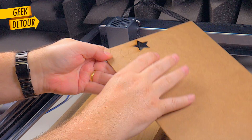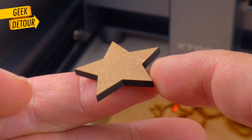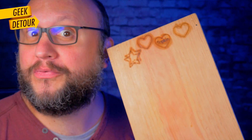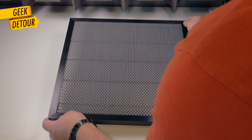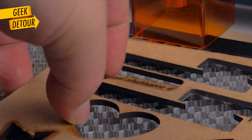Wow, this is amazing! This is insane! Oh my goodness, I still don't have words — the precision blows my mind. When you cut, the laser doesn't know when to stop, so unless you hate your tabletop, you need a sacrificial material underneath. Cutting wood makes a lot of smoke and the parts get very stained. You can clean much of the stains with magic eraser. But if it is possible to reduce smoke and stains, the solution seems to be a honeycomb panel with a protection sheet. After using it a few times, I am totally convinced the honeycomb is a must-have.